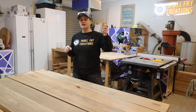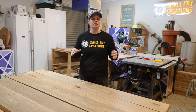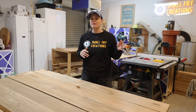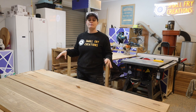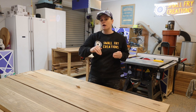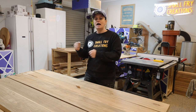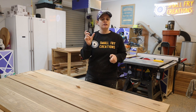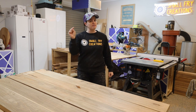I'm going to use biscuits to help with the glue up. These are not going to add strength but they will definitely help with alignment top to bottom. I used them in my dining room table project and they were the hero of that project. To cut the biscuits I make a mark where I want the biscuit to go and then a mark 30mm beyond that point, and that's how far I need to move the router. That'll give me a really nice slot for the biscuits to fit in.